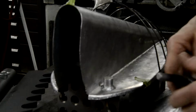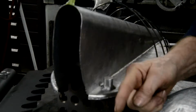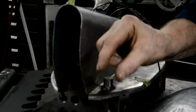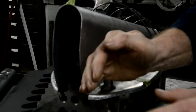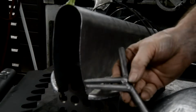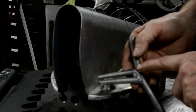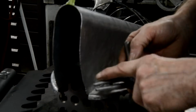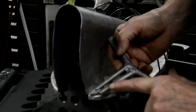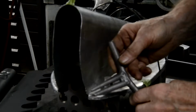And you remember when I was beating into the shrinking stump, how the edge formed ridges like that, and then you fold the ridges in on themselves so it pulls the metal in. Well, that's what this is for. So I actually made this with the big sanding disc to get the taper. I did it on the lathe, which I was quite pleased with.